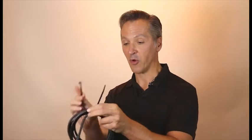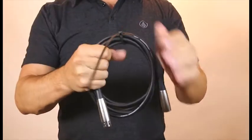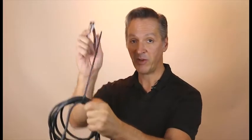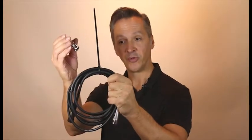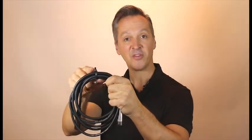Make sure all the wire tie heads are on the same end. That way they always pull out smoothly even if you're carrying them in your back pocket. When you're ready to use your wire tie, just wrap it around your cable, cord, or whatever you need to control and cinch it down tight. Instead of cutting off the extra tail with a pair of wire cutters, get yourself a pair of heavy duty nail clippers. Use the nail clippers to clip off the end — now you've got a nice smooth edge that won't poke you or anybody else reaching for the cable or something nearby.